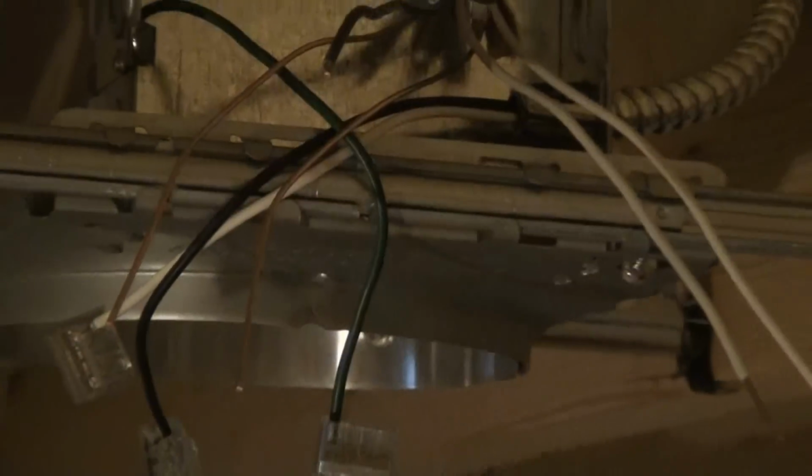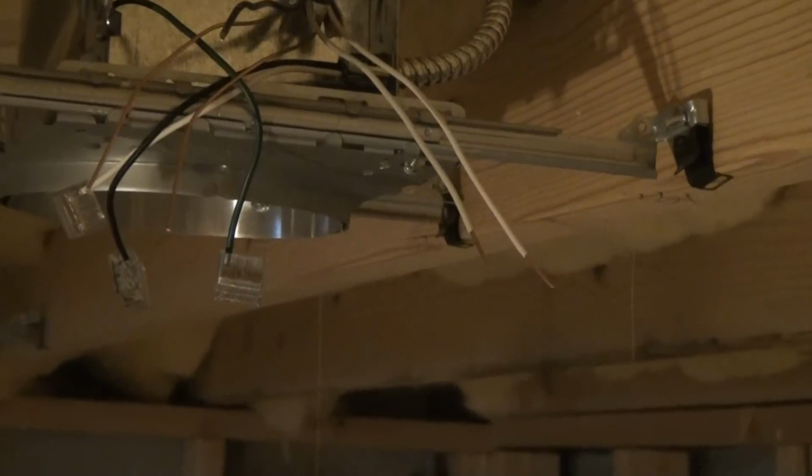All right, so once you have all of your 4 wires stripped back, now what you're going to do is, if you look real close here, you can see 2 plastic connectors. All right, they just moved. I'm trying to catch them with the camera here, but the electrician's moving them. Stop moving those. All right, there they are. What we're going to be doing is, you can see you got a black one, a white one, and a green one. All right, the green one is going to have the 2 ground wires stabbed into it. They're called stab locks because we're not going to have to tighten any screws or anything. We're just going to push the wires into the connectors. All right, so let's grab the black one first.